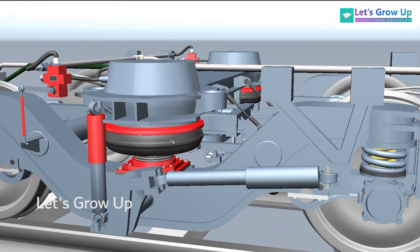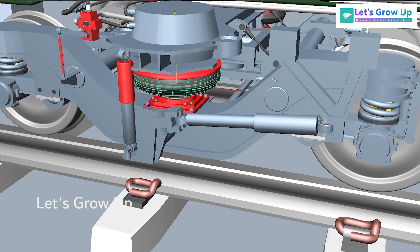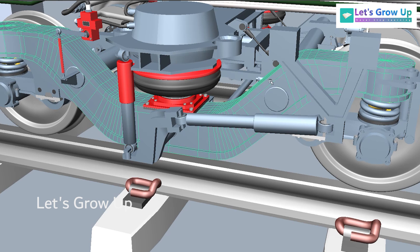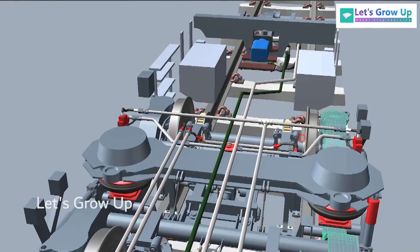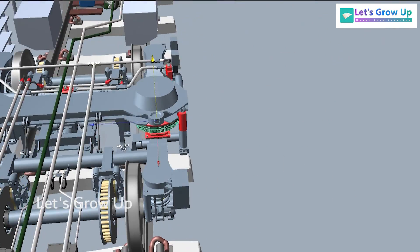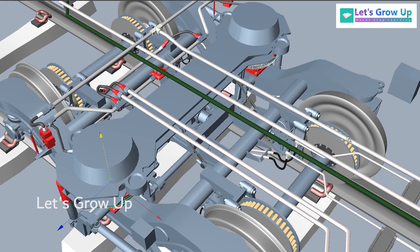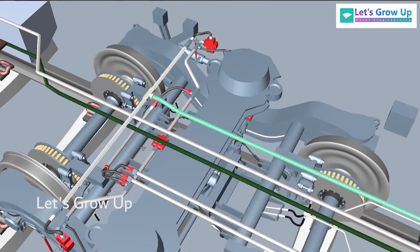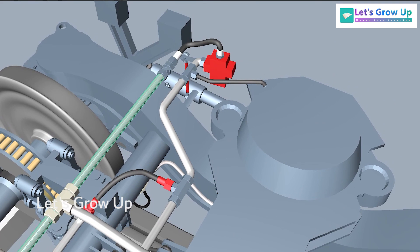FIBA is an additional device for the air spring bogey — the secondary suspension system. In a bogey there are two air springs. This is the bogey side frame, with one air spring on one side and another on the other side. Air is needed for the air springs, which is why this pipe through this T-joint is going to both sides.